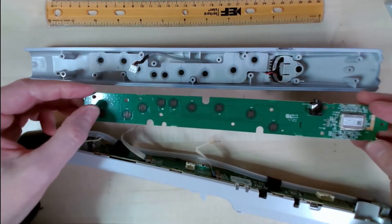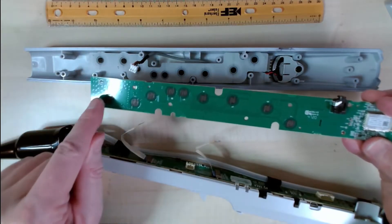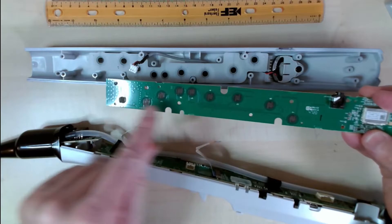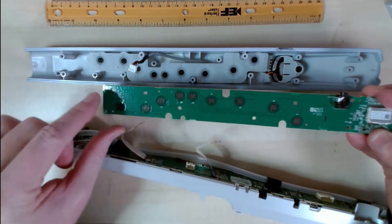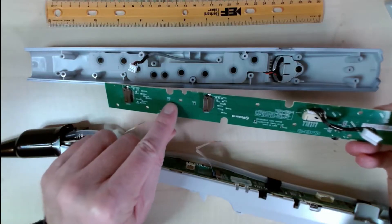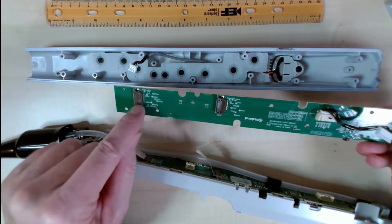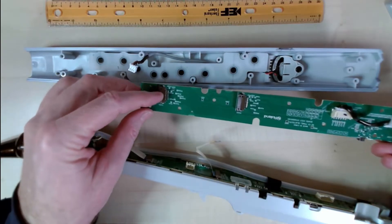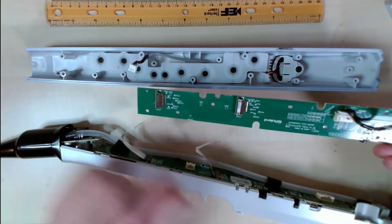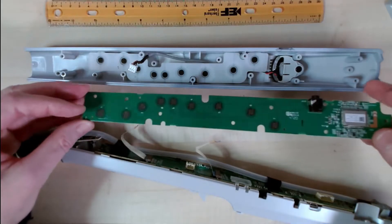Each of those are paired up — there are two buttons and each button has a mate, except one of them. Like 1 and 4 go together, and there's a diode matrix and they share the resources for this connector here in order to talk to the microcontroller on the other board. That's how that works.